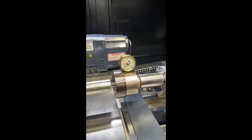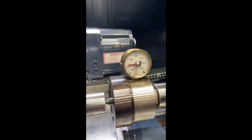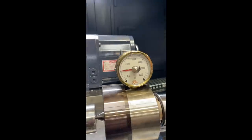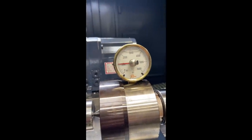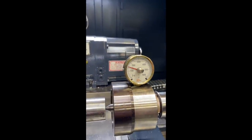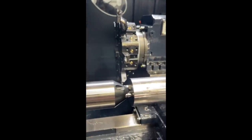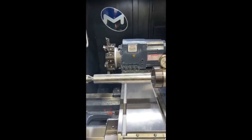We're going to apply a little more pressure to the tailstock quill again. We're going to take this one up to where we're going to go, 1500. And you can see that it's really taking some force on the hand wheel to get it there. All right, 15. So we're going to pull it back out and check our witness marks there from the drive pins. All right, so we've swapped it around.